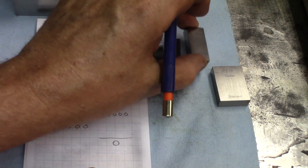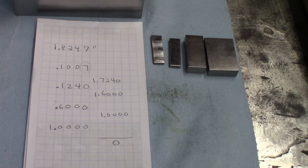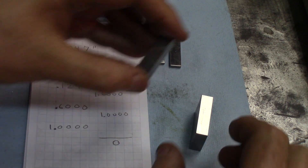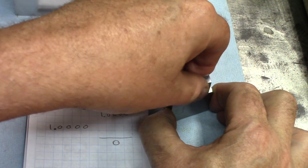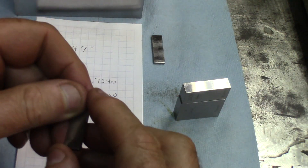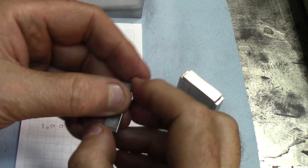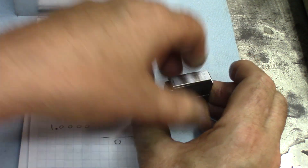We got 600 thousandths and we got an inch as the last number. Easy operation to do now is to wring them up. Usually a bit of body grease will do the job. Apply a little bit of pressure, slide it on — and it rings, solid. Same thing for the next one — ring it. And holding just the last one. There we go. This stack is solid.